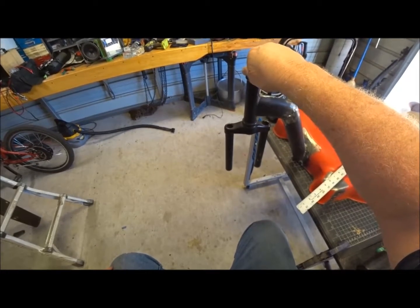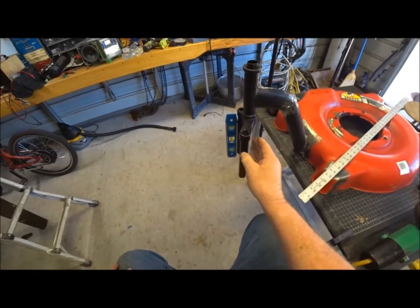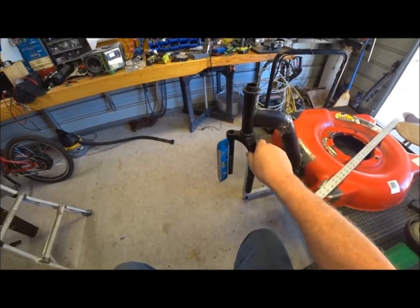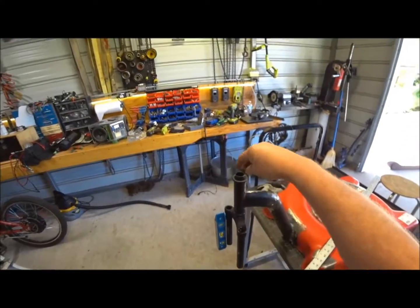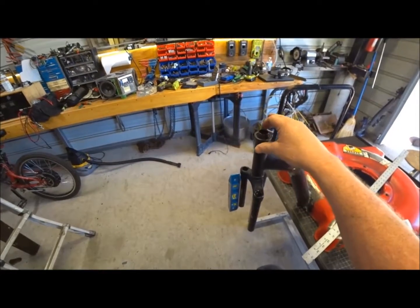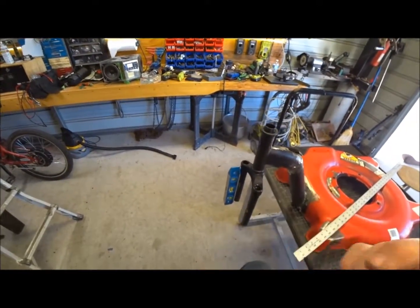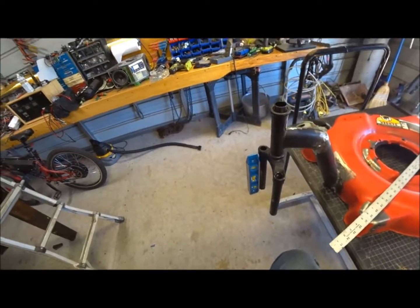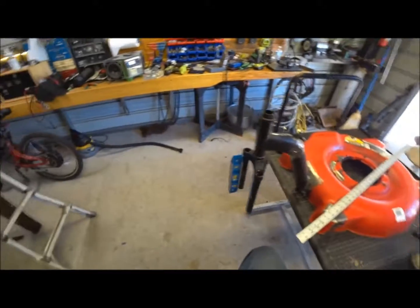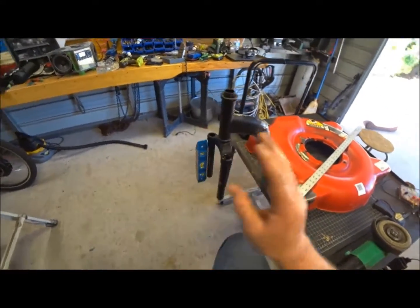That's the reason it's real important, and even this little offset right here is going to make a resistance difference. But if you notice the picture of the gearbox, it had the 3 prongs in it. What I'll do is get a piece of shaft stock, drill the size of the shaft, and then cut keyways in them. Now, if you don't have a keyway cutter, there's always a file, and you can cut it with a file. There is some welding you have to do.